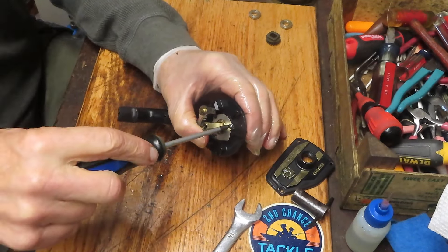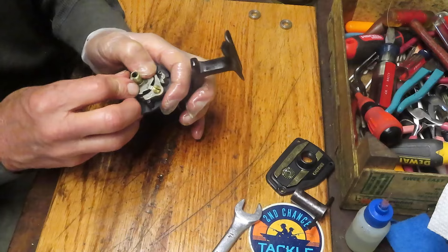I'm going to make sure I hold the next two screws up - the first one seems to be the more difficult because you've got a floating plate there. I didn't tighten that first one down fully because I needed a little bit of play in the alignment for that plate. Now that I've got two in, tighten that down. This third one is just the middle screw. Take the little spacer - this has got a square and there's a square on top of the spacer. There's that little tag there - make sure that you just flip it under that tag; you don't want to bend that tag.